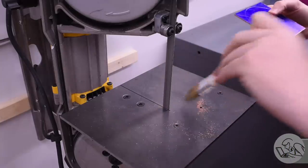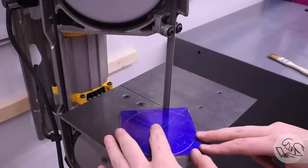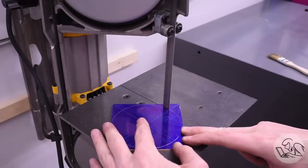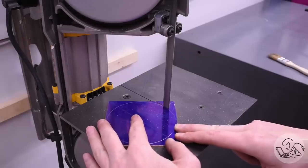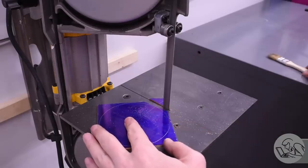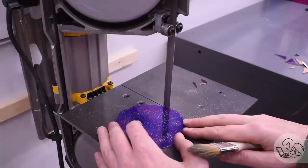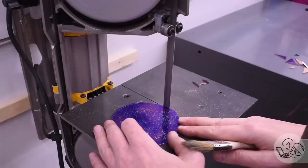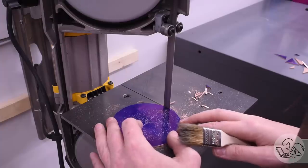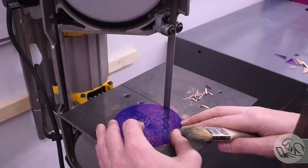Then, much like with the wood, I start by rough cutting out this circle on the bandsaw. Interestingly, the dimensions of the copper are much more approximate. Because we are going to be hammer forming it, it's going to be a fairly rough piece when we're done anyway. So the size of the copper that is given to you by the drawings is basically a little oversize. So it's sufficient here to just cut to my layout lines, and that's going to be close enough. We don't have to machine to a super accurate dimension here because we're going to be hammering this over the former in any case. And then the final copper part gets machined down to final dimension.